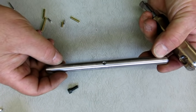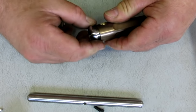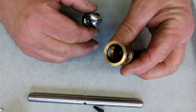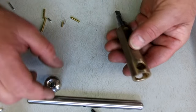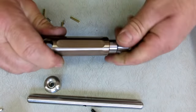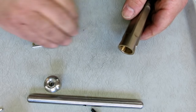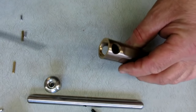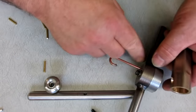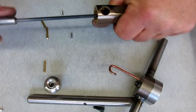Okay, it's got a cross hole there. And then this little cap comes out, like so, okay? And then that exposes the hollow down the middle of this thing. Now, right now, it's declutched. The pins have been sheared, so let's reach down there. Now, you know, it's very similar to this. It's got a fastener down the center that kind of holds the two halves together.